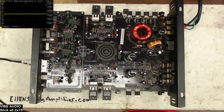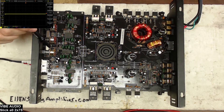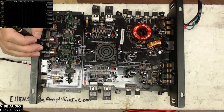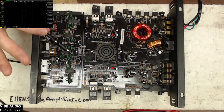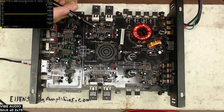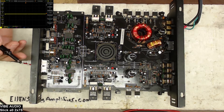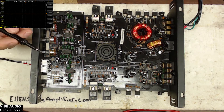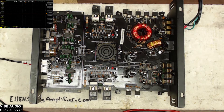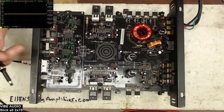I'm one of those technicians where if I see a one or two volt difference on the outputs, I'll always go back to the gain potentiometer. There's typically a set of resistors after the potentiometer that can drift out of tolerance, causing a difference in amplitude between the left and right channels as you increase the gain. When you have one common gain control driving two separate channels, you want to keep those channels as close as possible in amplitude — that way there's no problem with your soundstage in the vehicle.